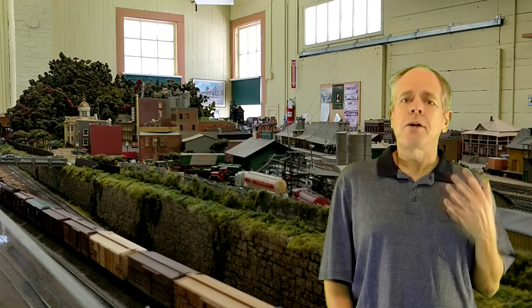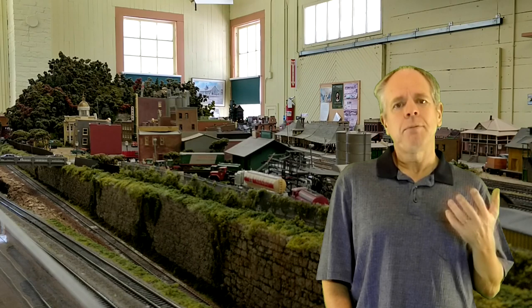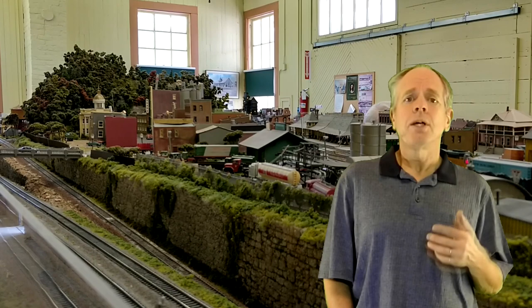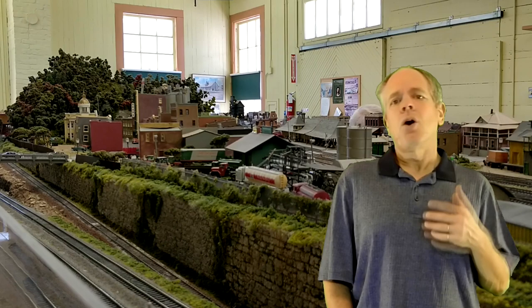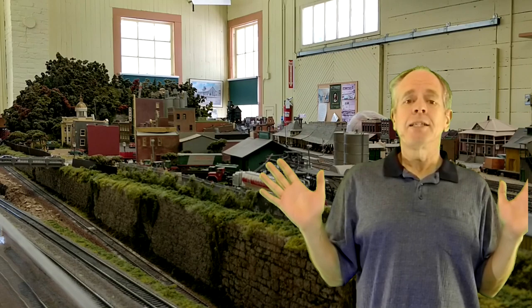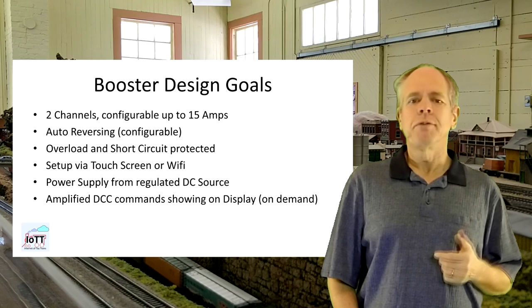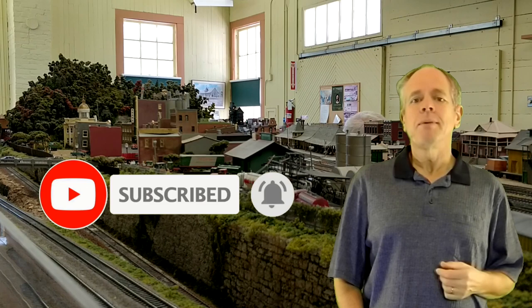I also noticed that the current amplifier factor really is different on each module. So for the final hardware version, I need to plan for a potentiometer so that the measuring range can be calibrated, and I will also make the conversion factor configurable in software. With that, it will be possible to set the zero detection point using the potentiometer, then use the software factor to determine the slope of the conversion curve, resulting in reliable current measurements over the entire range of 0 to 15 amps with a precision of 100 mA. Overall, this looks very promising. With those research results, I hope to build and present a working 2-channel 15A booster in just a few weeks — so it's probably a good idea to subscribe to the channel and hit the bell icon.